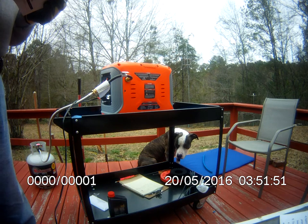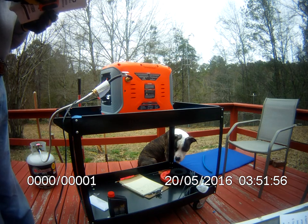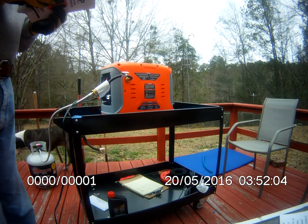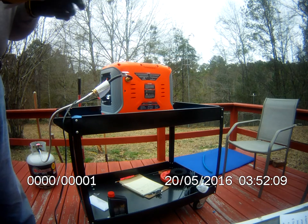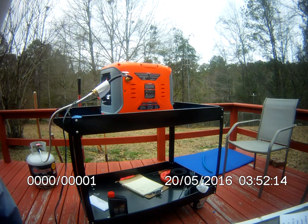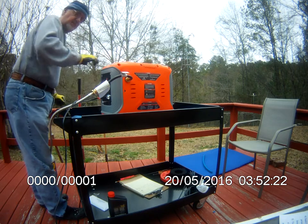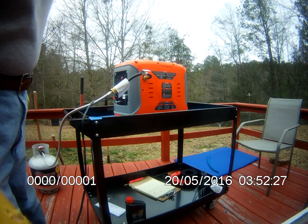During cold starts, move the choke switch slightly to the right towards the start position. After starting to warm up, move the choke back. I don't see anything here that says what mode to start it in, so we'll do it with the Econo mode off, and with the choke partially toward the start position. Maybe right in the middle. So here goes nothing.